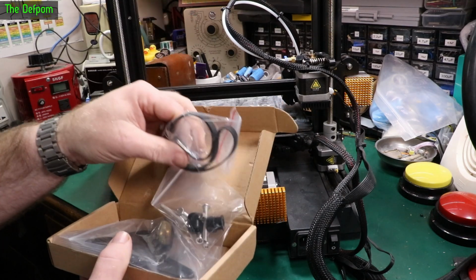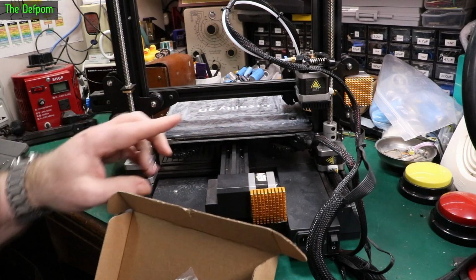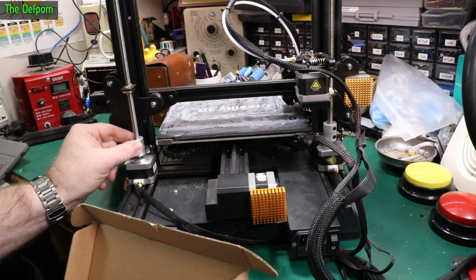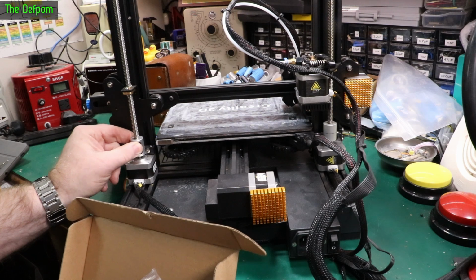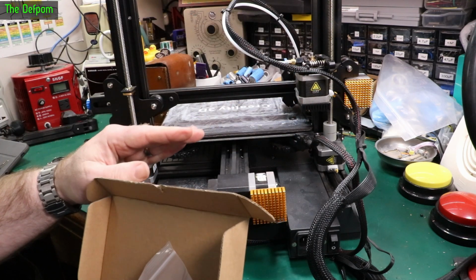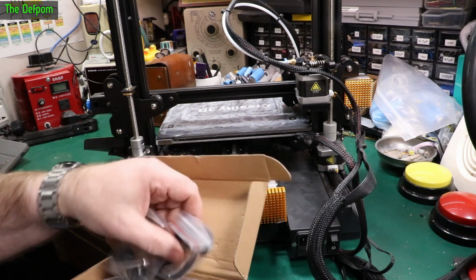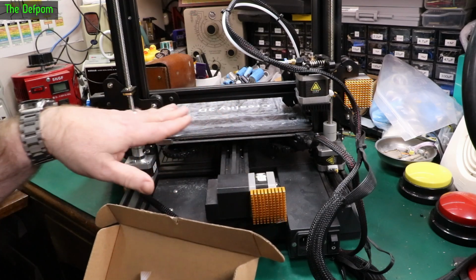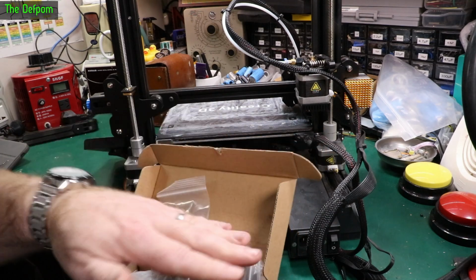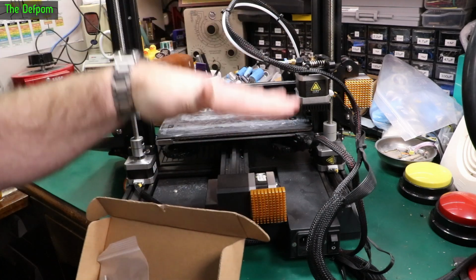What I'm going to do is combine the best of both worlds, hopefully. So I've got dual motors. Now the trouble with dual motors is that if this goes out of whack and it starts being on a bit of a lean, because you turn one manually by a little bit, for example, and it's changing axis, it will stay that way. Right? Which is why I wanted to put the pulleys on this with the belt, and then I can set the horizontal of this and make sure that, because of the pulleys and the belts being tied together, it ties the two together, and that way they'll always stay in sync and it will always stay dead vertical.